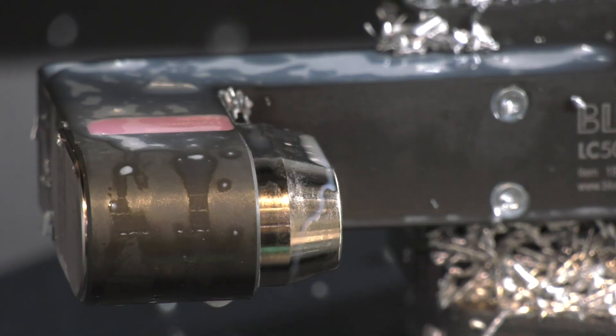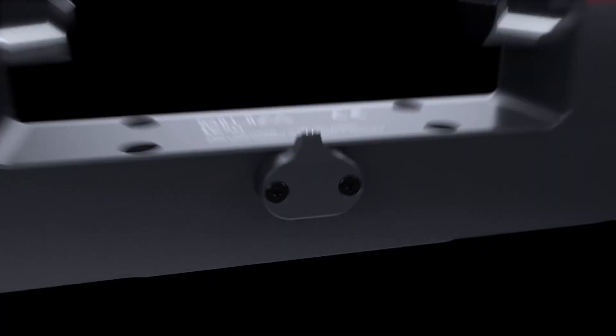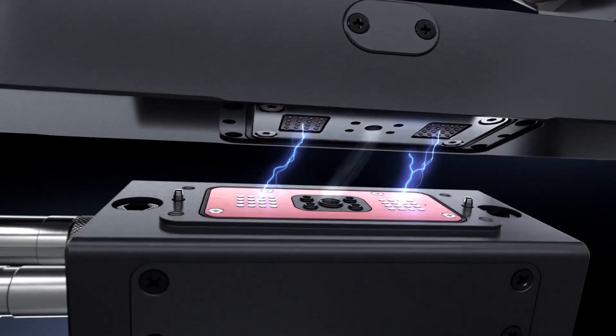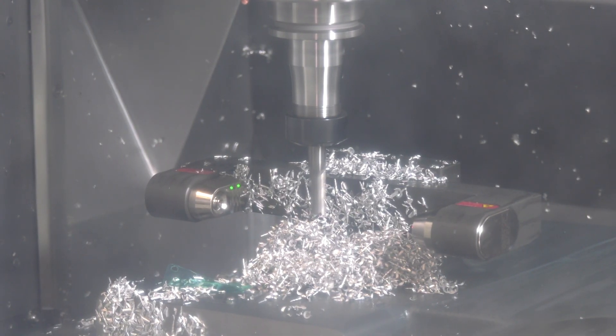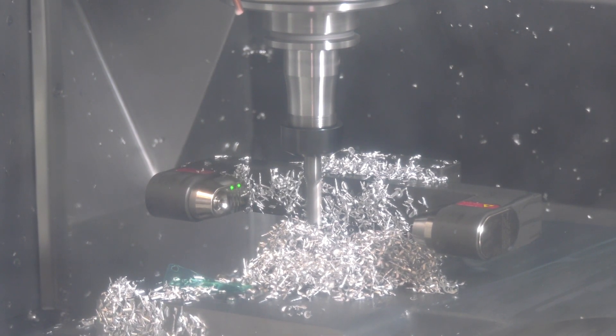We're really pleased to be here today at Playlight and we're really happy that our new probe is installed onto this machine because we feel it represents the next generation step up in digital and analogue technology. The LC50 Digi-Log laser does conventional on-off technology but also an analogue scan which takes thousands of additional data measurements and parameters of the tool, enabling high precision measurements to be taken, scanning data to be put back to the control, and decisions to be made on the quality of the tool.